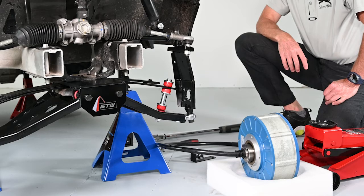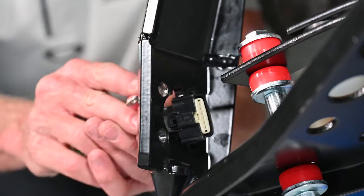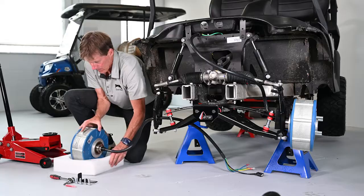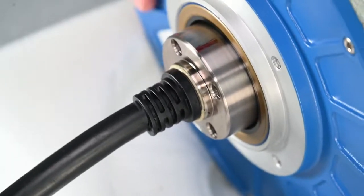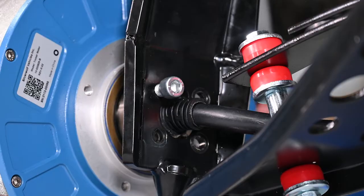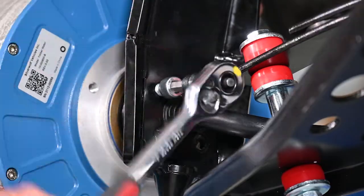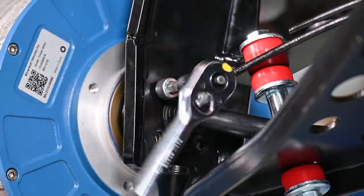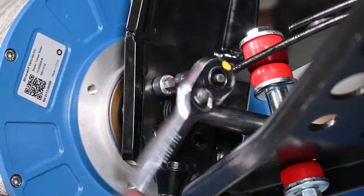With this in mind, set the motor on a piece of foam in front of the adapter bracket. You can now gently insert the motor's cable through the adapter bracket hole and let it rest under the cart. Leave some slack in the cable to allow the motor to be lifted into place. Transfer the motor onto the floor jack. With the mark at the top of the motor, slowly raise the motor to align it with the adapter bracket and slide the motor into place. Check that the four bolt holes on the motor are in line with the adapter bracket holes. With the motor now in place, take careful note of the sequence of connecting the bolts — do not jump ahead and install all the bolts and do not use threadlocker at this time. First, install only one of the M10 by 25 mm socket cap screws into the front upper hole. Do not install the wire guard or use threadlocker. Tighten in place with a ratchet, but note this bolt will be temporarily removed later.